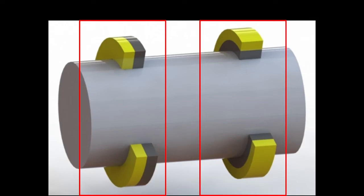After installing each ring and tamping them into place, the gland should be pushed against the top ring and the bolts should be tightened finger tight. Now we are ready to start the pump, and we will be discussing that in the next video. Thank you again for watching — if you have any questions, feel free to reach out to me or my team.